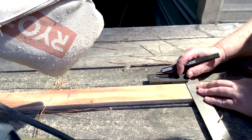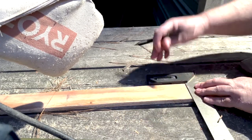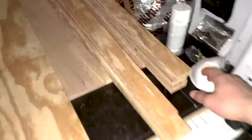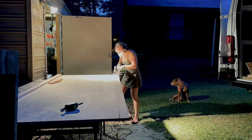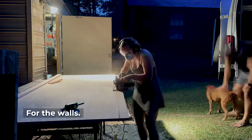Find that mark a little bit because of the width of the pencil. So we have our 55 inch studs that are going to go up the top — we've got six of them cut. But what we're thinking is that we're actually going to use the three quarter inch plywood beams. We're about to cut our two and a half inch strips for that.